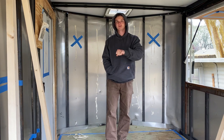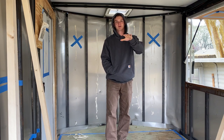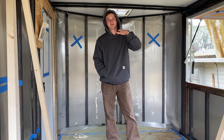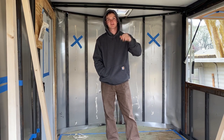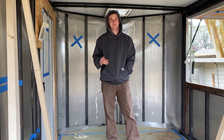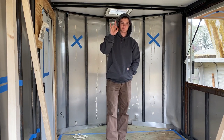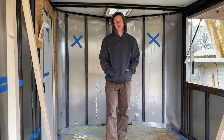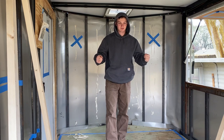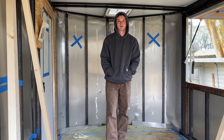I'm gonna set up the saw horses slightly lower so I can fit that big rectangle in underneath the existing joists. I'm gonna make traces with my soapstone on the joists, and then from the inside of the box, I'm gonna drill upwards, create four holes at the inside corners, and then from there, go topside and do a chalk line in between those holes.